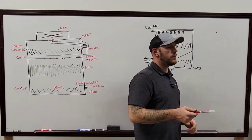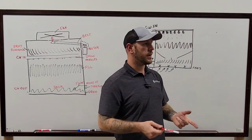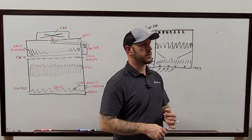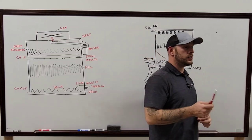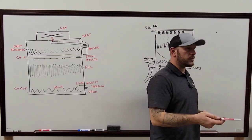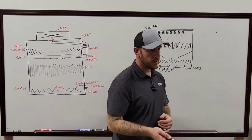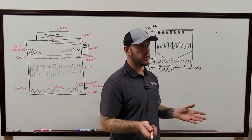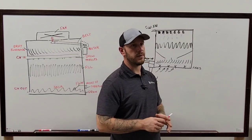You know how most of the time on blower housings and all that kind of stuff, they have all the V-belt drive information on there. Usually there's a stamp, especially in these new cooling towers, right on the mechanical beam or right near the motor, and it'll tell you exactly what the tension needs to be. But if not, look up the manufacturer specs. It'll usually tell you right away. It's pretty easy to find.